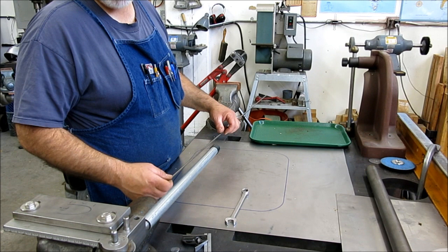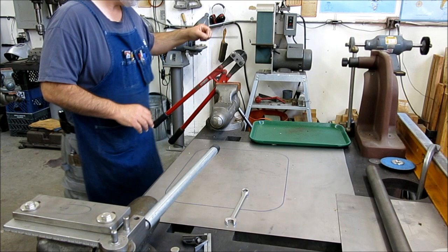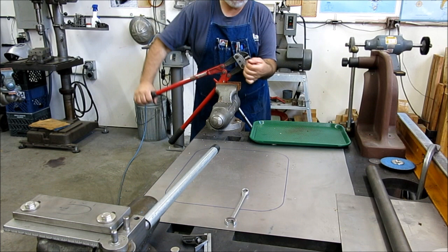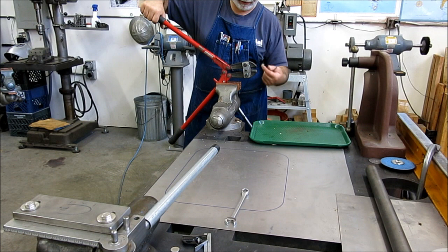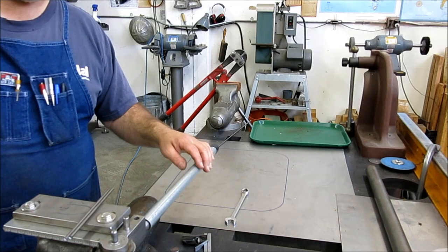We're going to make a couple of samples of these hooks that John makes. I've got some steel rod here — John used stainless steel for his, which is the right thing. It's about 5mm rod, something like that. And we're just going to nick off a couple of pieces here. You see I've got the bolt cutters in the vise — sometimes it's more efficient to have the tool clamped and bring the work to the tool. I'm just going to nick off a couple of pieces; these are 150mm long, something like that. I'm going to zoom in on the bender here and we'll get a closeup shot.